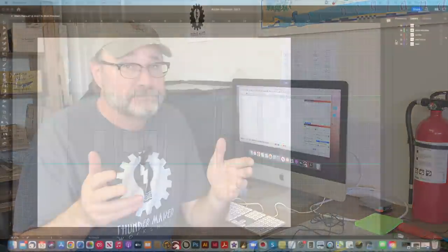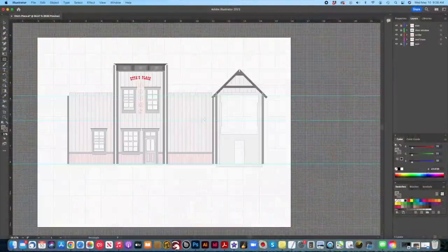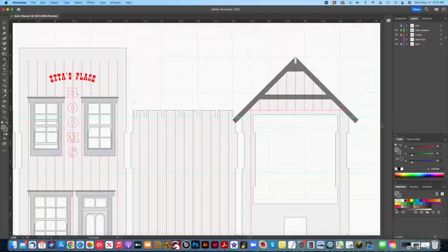Now, your laser cutter machine is going to read all of those pixels as dots and etch them accordingly. No matter what kind of machine you have, a raster graphic can take a long time to engrave. Fortunately, in structure modeling, we're usually dealing with vector files. In fact, that's all that we're going to be using in this project.